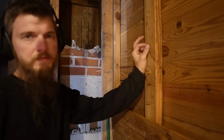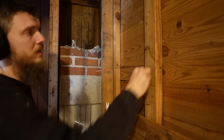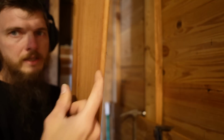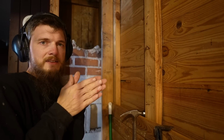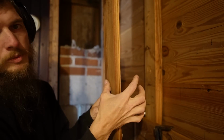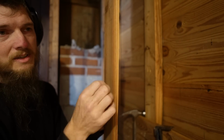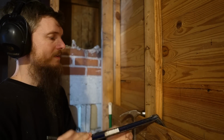Now you'd think, why would they use a big fat square nail like that? But actually a square nail can be better for tongue and groove boards sometimes because that flat blunt end pushes the wood out of the way when you're nailing it into the groove. So it's pushing a hole through the wood, nails in tight. Whereas a regular nail has a pointy end and it's designed to spread the wood. It squeezes in, spreading the grains of the wood. And what can happen is that could end up cracking the board because a pointed nail spreads the wood open, crack, whereas the square nail actually just punches right through the wood and doesn't spread the wood. Does that make sense? That's why they use square nails for tongue and groove, because it was less prone to splitting.